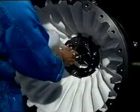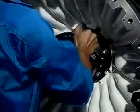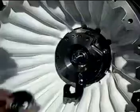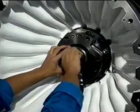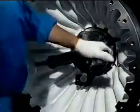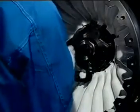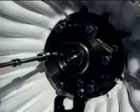Apply lubricating oil to the bearing and its holder. Install the bearing. Install the centrifugal dirt separator, then fasten with the ring nut. Tighten the ring nut with the box spanner. Tighten the ring nut harder with the box spanner from 0 to the specified scale. Install the bolts.